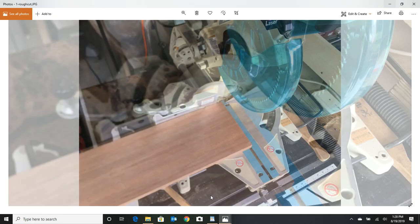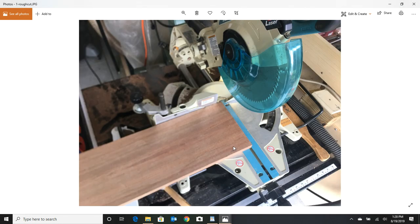The unit was made out of rough cut lumber — all air dried, mostly black walnut and a little bit of cherry. The first step is to get it knocked down to size. Most of the air-dried lumber I have is at least three quarters of an inch, most of it an inch thick. If I were to build an organizer out of three quarter inch lumber, it would look like a container for transmission parts, so we had to slim it up a bit.